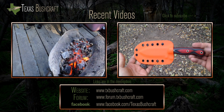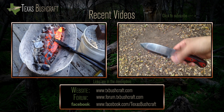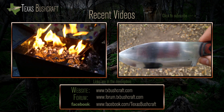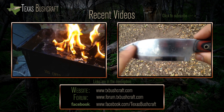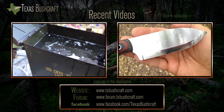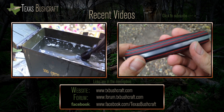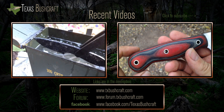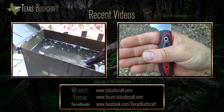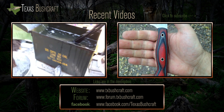I'm going to try to hold this in my left hand while doing this. We're going to be calling this the Texas bush knife — sorry about the bumpiness. This is just a prototype. You can see I've got it in the quench — the quench is just canola oil, about a gallon of canola with the heat treat additive in it. You can see it's smoking up; it doesn't smell really bad, kind of like a deep fryer. The handles are made out of canvas micarta and I'm just agitating it up and down — straight up and down, not side to side.